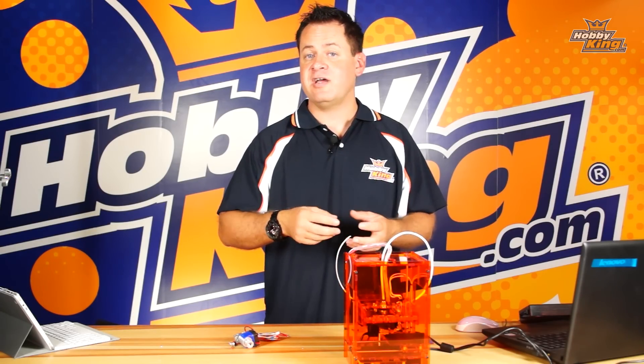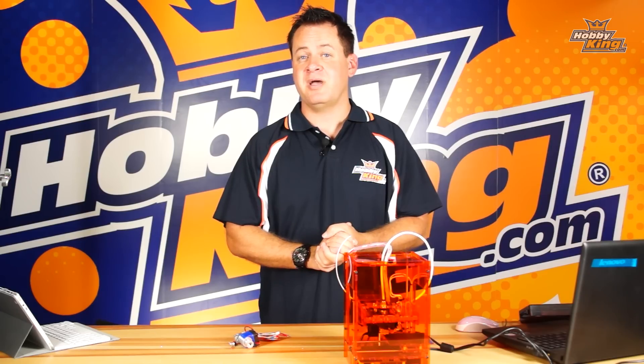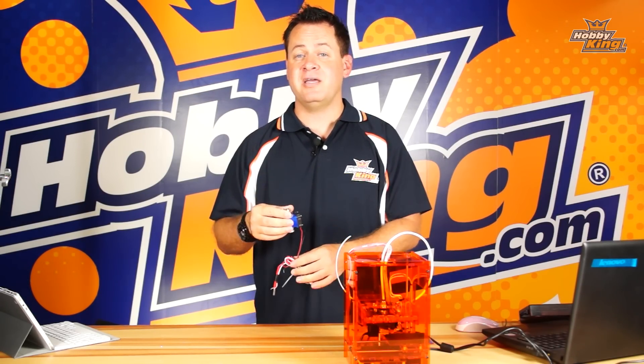Unusual noises can occur when your printer is trying to home itself or during 3D printing. Over time, belts can become loose or tight, and plastic from the printing process can get up into the rails causing binding issues. It could even be something as simple as the fan getting rotated and touching one of the housings on the outside.